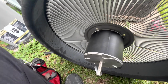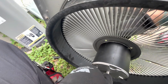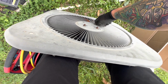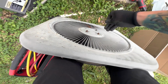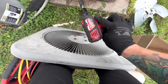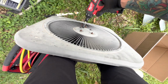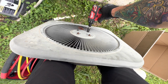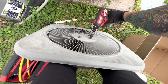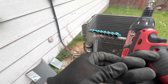And when you tighten these motors down, do not, I repeat, do not use your impact at full force, because you're gonna break these small studs that go through the motor. So usually tighten down by hand. This is not an impact, this is a screwdriver. And I like to tie them in an X form. Oop, there we go. That's in.